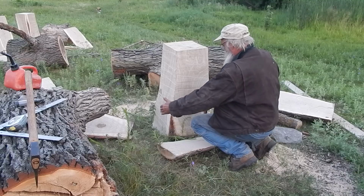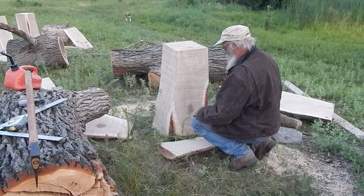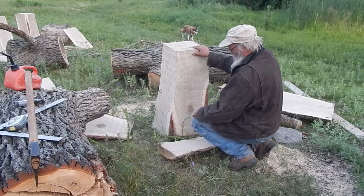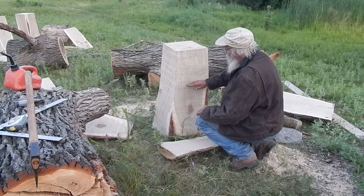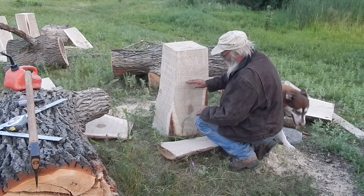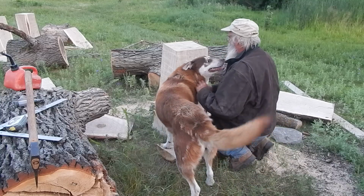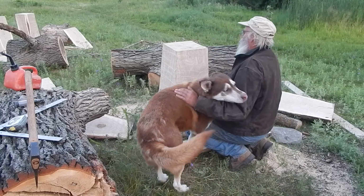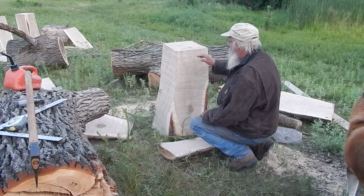And like I said, then I'll pour a big slab of concrete, or not slab, but just a kind of a pad that they will sit on. And that way it'll be deep enough down in the clay. And then these will be pine tarred up to here. And I won't pour cement over the height. It's going to be a flat pad, because like I say, I don't want any dish shape to it. It's got to be so that it drains the water off, to make them last.